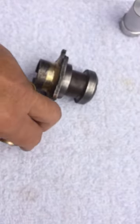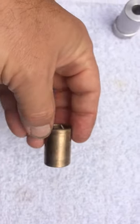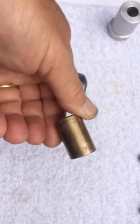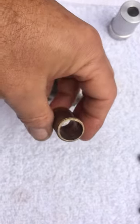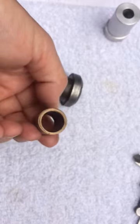One thing I did notice on this one — even though it has the lubrication grooves inside, apparently this must have been retrofitted at some later date because it was never drilled for the oil hole. Kind of strange. Somebody shortcutted it, I guess. That's probably one of the reasons why it wore so bad.